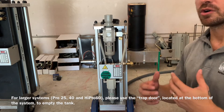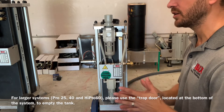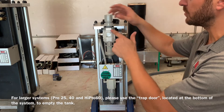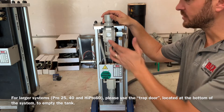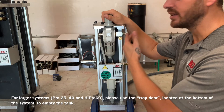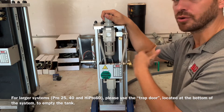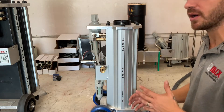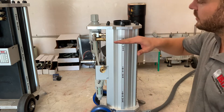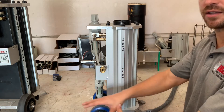If it is a little bit more extensive — let's say if you've used baking soda — baking soda is a great product but it does tend to stick to any kind of surface if it gets any kind of moisture to it. So if it does back up into the pressure regulator and jam it in the sense that you won't be able to regulate the pressure, you will have to clean that out. We do have a maintenance video on how to clean out that pressure regulator thoroughly on YouTube as well. Once you've emptied the pot of material and purged the line, go ahead and refill the machine and try to leave about two to three inches of space from the top so the air can work its way above the material and push it down through that hose.